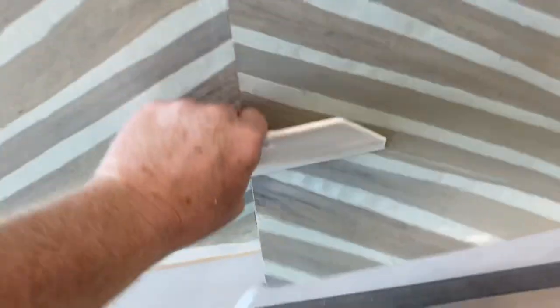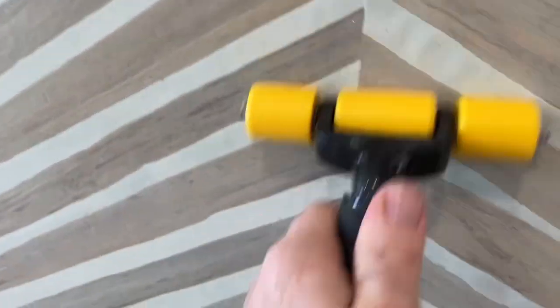Don't rush this when you're dealing with natural material - you can really mess it up. There's a slightly dry spot there - I'm going to try to get that glue to stick without getting it wet on the edge. And that's how you do your double cut on this special natural product from Philip Jeffries.